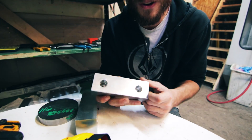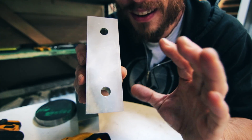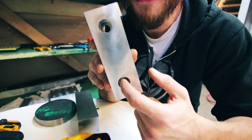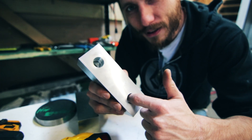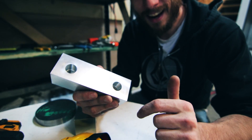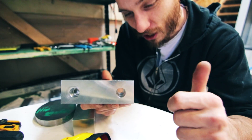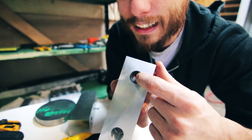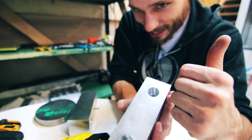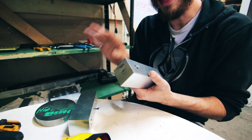It took me a bit to figure out the program. You can see in there a bit - there's a little stepped hole, so I need this lip at the back here. It's really far - it's under the bottom of that hole, I have to drill in and get that lip. It's easy enough to take a half inch drill to get all the way down, but to get that lip I need a necked end mill and I don't have one. So I'm going down with the 7/16 bit because it's just undersized, and then I blast out the outer edge. I leave a tiny little lip in there which gives me the clearance I need on my big half inch bit which has the reach to get to the bottom of the hole. I'm pretty pumped because this is the first thing I've ever made on my machine and they are so tight - I'm really happy with the program.